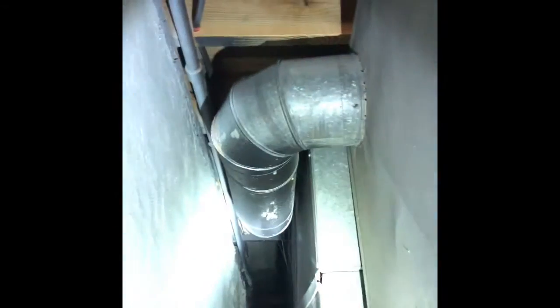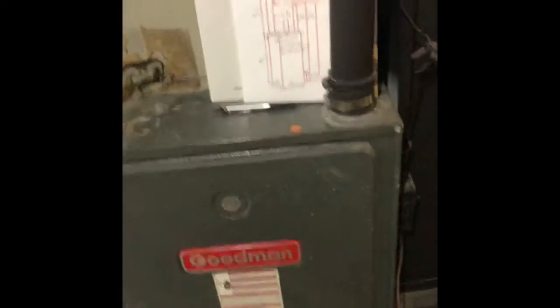There's another supply back here that goes up to the kitchen, and we'll attach that one back to the plenum as well. All the rest of the ductwork is going to stay as far as our supply goes. Our return is going to get replaced from the bottom of the return duct down to the floor. We'll put our 5-inch media cabinet in somewhere we can fit it — we may have to bump the whole system over just a little bit because there is a beam in the way right here.